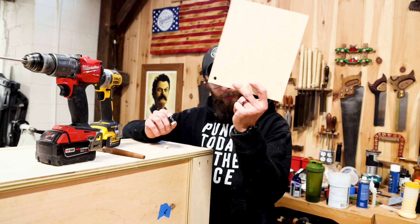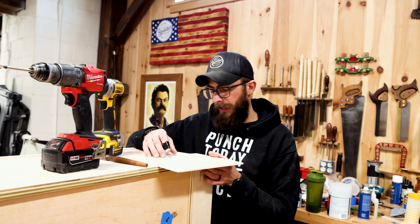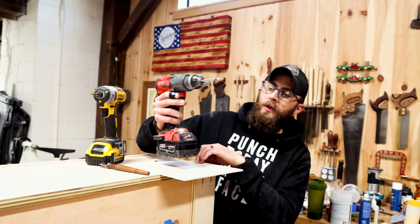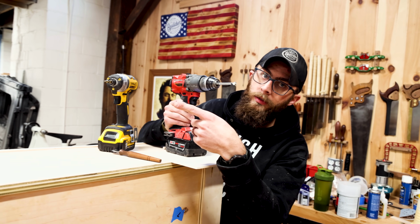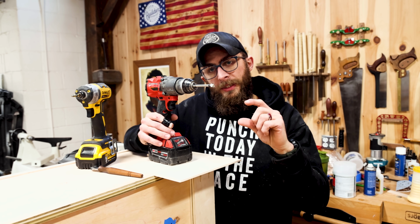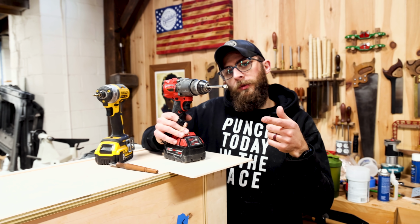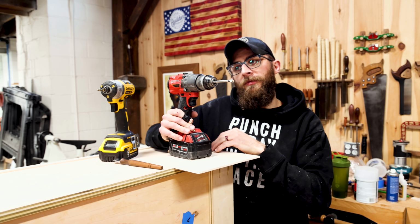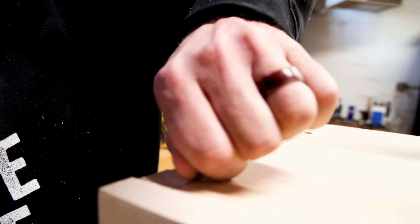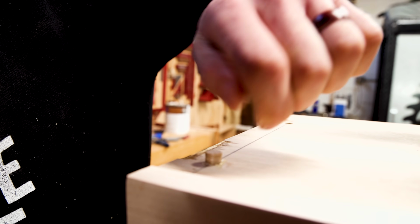I made a template with a hole in it so I can line it up over the hole, and then I take a Forstner bit, which has a corresponding plug cutter. I had Jordan make some plugs. I'm drilling out the holes, making them a little bit deeper, just enough to accept a plug. We'll put some glue on a plug, put them in there, sand it smooth, and then we're gonna Bondo over all of the plugs. So just don't tell anyone, okay? Plug and chug. I'm gonna get the glue spread around. Another plug, my boy.